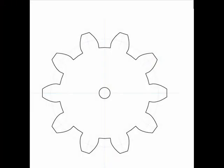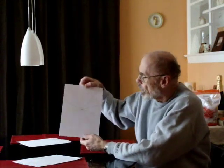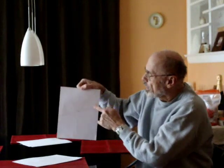With a little experimentation, you should be able to generate a pattern for your gear. This particular example has 10 teeth. In addition to the profile pattern, you'll need an index pattern or tooth position pattern. I've opted for index lines generated by a CAD program — 10 index lines equally positioned around the center.